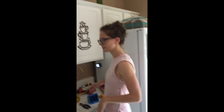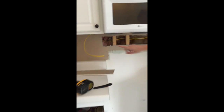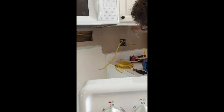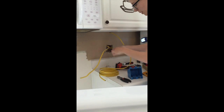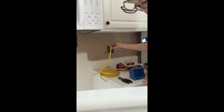Go ahead and measure out the wire. As you can see, we have run the wires — starting here, pulled it through to here and then cut it. We've pulled this one from here down into here. Now I'm going to put the box in and pull these wires in so that we can splice these two together.